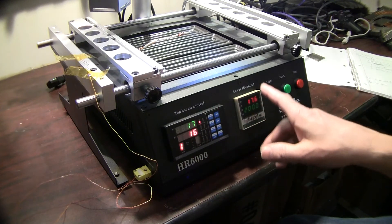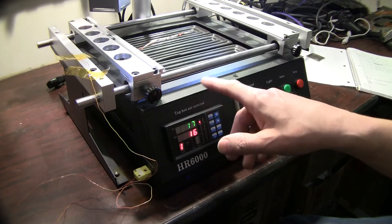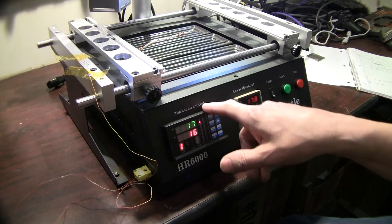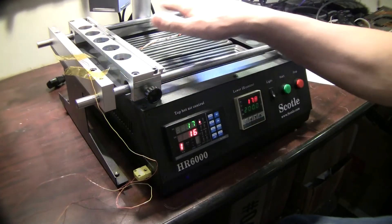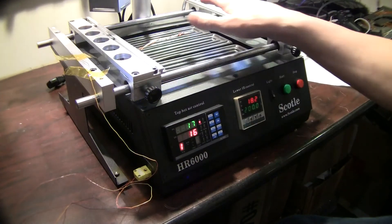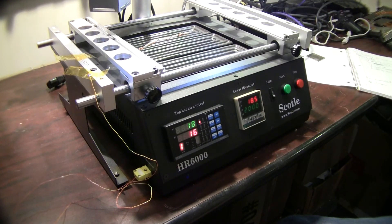You're specifically going to be setting your lower heater on and zeroing out these values. If you can't zero them out, you're going to need to put the times in, but you can just fudge the temperatures down to like one or ten or whatever the minimum your controller allows. Put your dwell times in for the profile, then set your lower heater and run it — that will run your bottom heater only with nothing really coming out of your top heater, so you can actually measure your preheater and make sure it's calibrated right, or that your lower sensor is doing the proper job. You'll see that in one of our other video series.